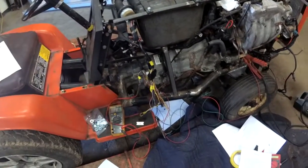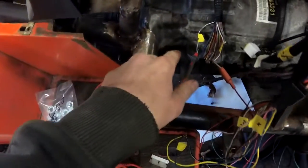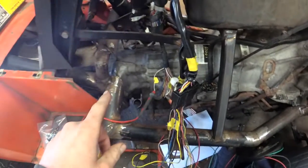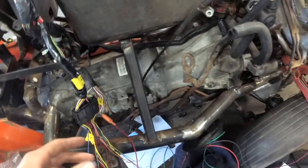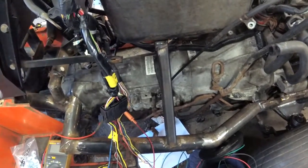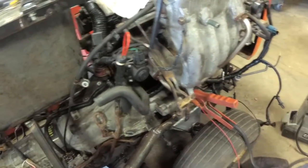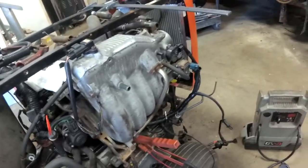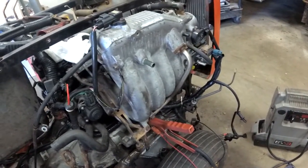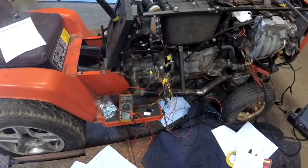I powered up all the pins that I needed to. Measuring the fuel pump outlet here — the fuel pump relay control went to ground when I turned what would be the key on. So I think the computer's actually booting up. It seems like it is. And I heard one of the solenoid valves clicking away over there adjusting — probably the idle air control. We're getting there.